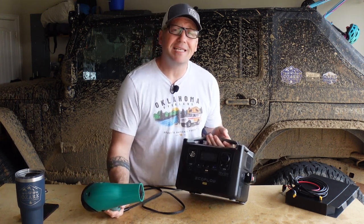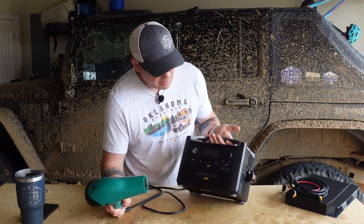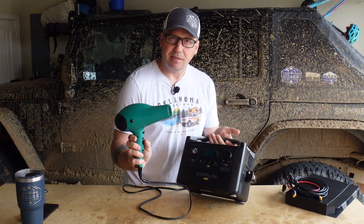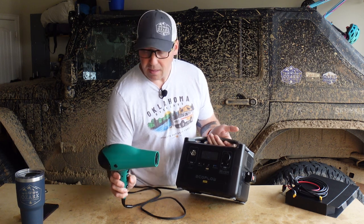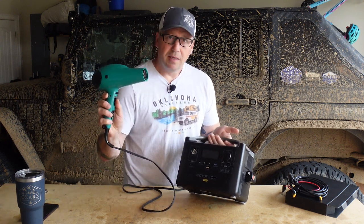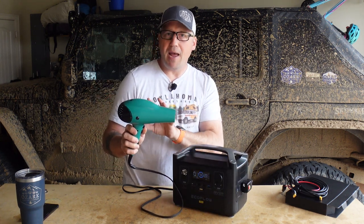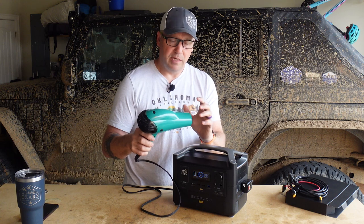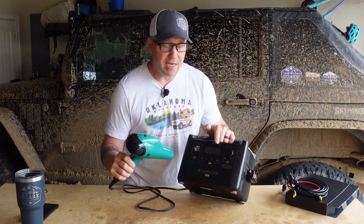We're now at 596 watts. So right at that 600 watt capacity of the inverter, still going strong. Now let's kick it up to high heat and see what happens. Did you hear the hairdryer throttle down? And that's because it dropped the voltage, so that dropped the power in the hairdryer. So now the fan's not working as hard. It is putting out a little more heat, but the display is showing that we're still at that 598 watts